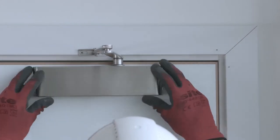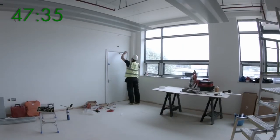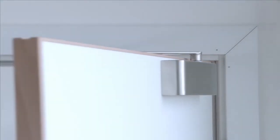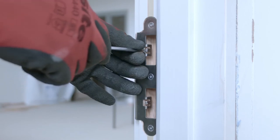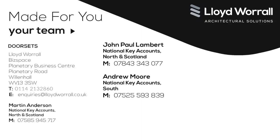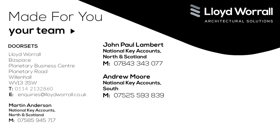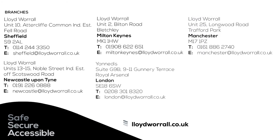The bottom fixing hole should be no lower than 700mm and no higher than 1000mm above the floor. There is no official guidance for the horizontal margin of the pull handle position, so it may be wise to check with the project design team. We cannot cover every bit of ironmongery in this short video, so if there are any special pieces of ironmongery which you aren't clear on how to fix or adjust, just give us a call.